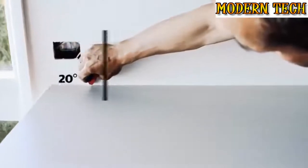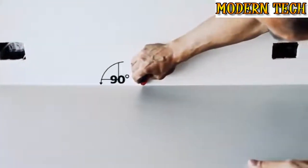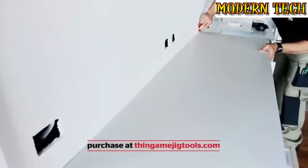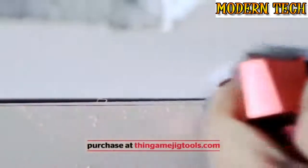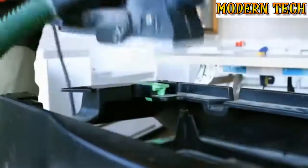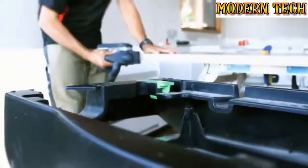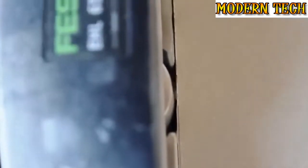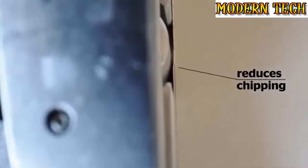Now simply hold the tool so it is at 90 degrees to the benchtop. Move the tool across the wall applying slight pressure against the blade to commence marking. Continue this process until you are happy you can see the scribed line. Now use an electric planer and trim off the excess benchtop to the scribed line. You will notice one of the benefits of the scribing tool is that the laminate does not chip past the scribed line, due to the scribing tool blade creating a break in the surface.